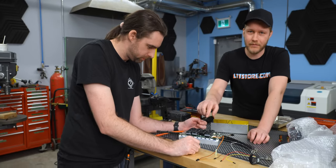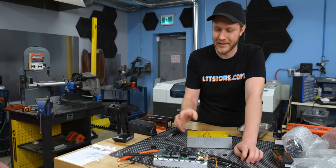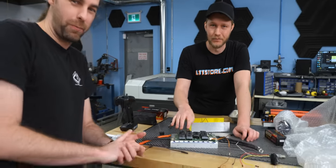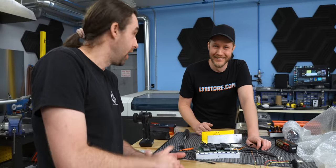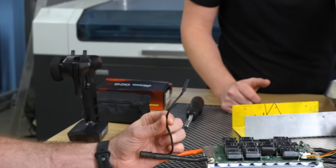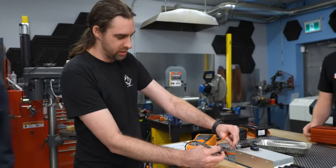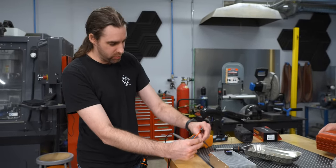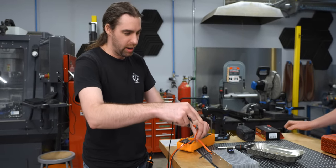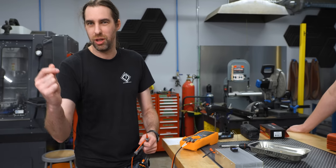One thing we have to be careful of with this is the inrush current. So you don't wanna just connect all of your batteries to this at once, because these will briefly act as a short circuit. Ah, yes, but they thought of that. May I introduce you to Mr. Spark Lead? So inside here, this lead is a resistor. If you attach these two points together, it will slowly charge the capacitors instead of charging them really quickly.